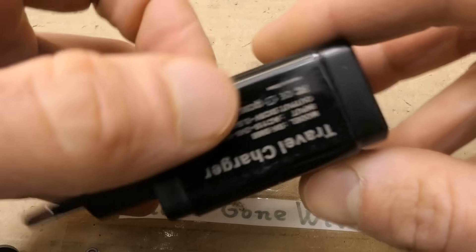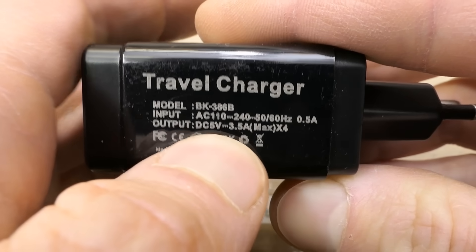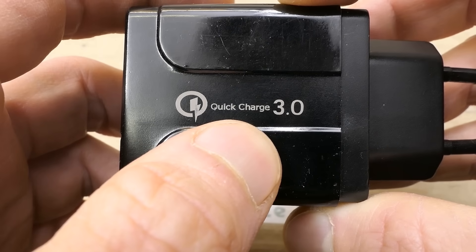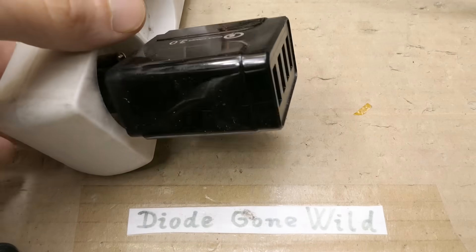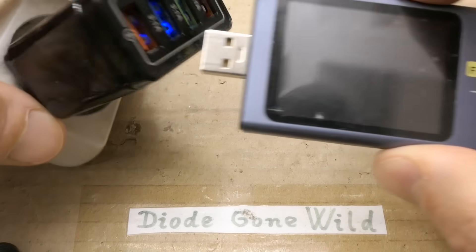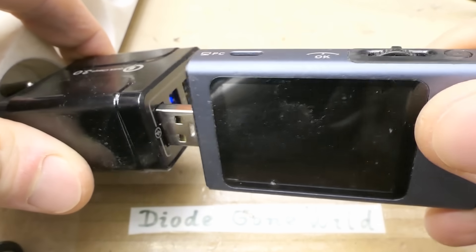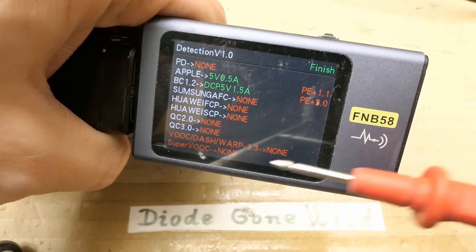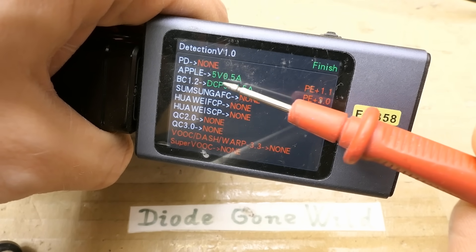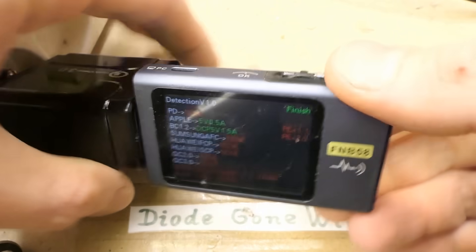So let's explore this one first. Let's try to load it — again it's just 3.5 amps at 5 volts but no other voltages, despite this one probably being able to do 9 and 12 volts. Let's plug it in. No explosion. Let's plug in this USB tester into the fastest port, if it's not all four in parallel of course. And detection — it really detected a lot, didn't it. Just 5 volts 0.5 amps and 5 volts 1.5 amps. No sign of fast charging protocols here.